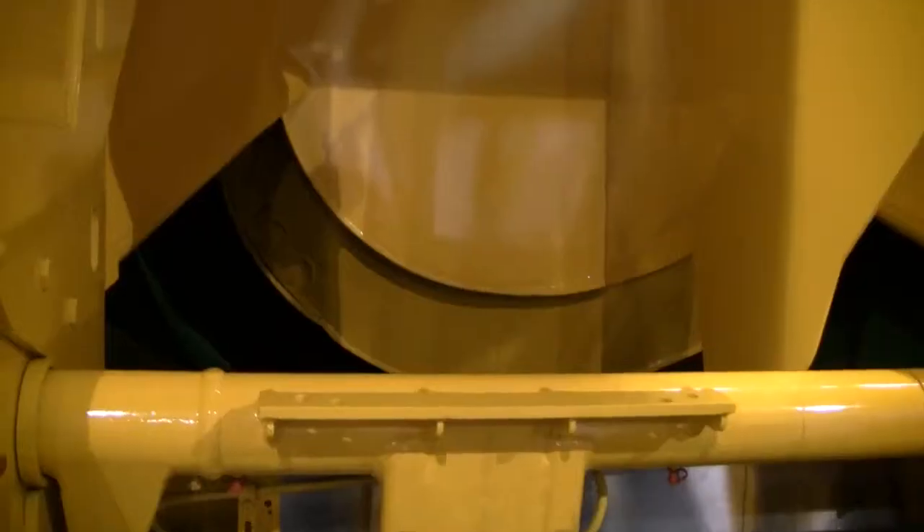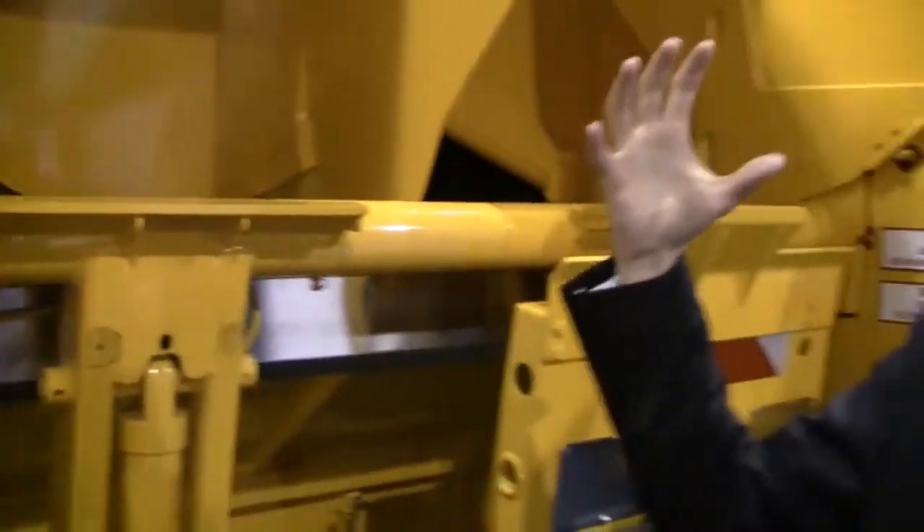So maybe we can go back to the rear end and I will show you what we do there. When the waste coming from the front end of the drum reaches the Roto Press, it is moving over the screw and thereby it's forced to go back into the drum. This means the waste is compacted only at the last portion of the tour. This is a big advantage of the Roto Press — it means you have less moving parts, less than 10 moving parts compared to a pack-up plate machine where you have much more moving parts.